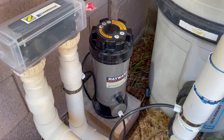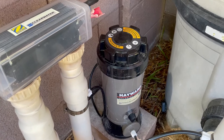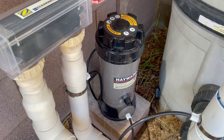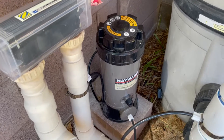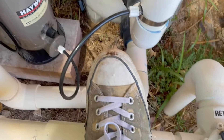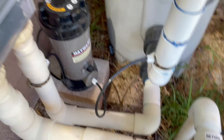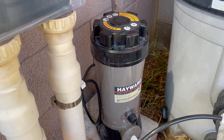The first time I opened this thing up — before I had attached the bricks to hold it still — I was leaned over it with one hand on the body and one hand on the lid. I was cranking really hard and when I opened it, a giant cloud of chlorine gas popped out the top — it's invisible, you don't even know it's in there — and it went right in my eyes and stung like crazy. My first reaction was to gasp, so I breathed in the chlorine gas, which is the reason I wanted to make this video. That same week I was wearing my Converse Chuck Taylors — they used to be olive drab — but I dripped the condensate from the lid onto my shoe and it bleached my entire shoe. So really what you've got is a jug full of bleach with bleach gas sitting right on top, so be really careful when you open this thing.